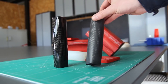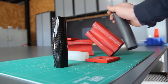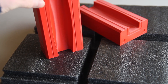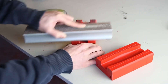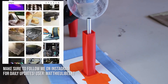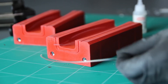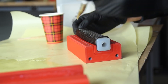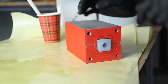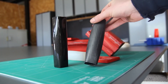Matthew Liebert has published a video on YouTube on how to make carbon fiber tubes using 3D printed molds. After printing the outer molds in Power PLA — a filament that can be sanded like ABS — he printed molds for silicone cores that will provide added pressure to the inner surface of the carbon fiber part. Some spare lengths of TPU filament create registration keys for the mold and prevent resin leakage. You get to see the whole process of carbon fiber layup, and the 3D printed molds for the part worked great.